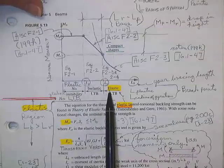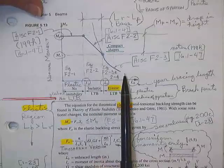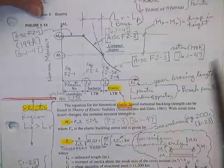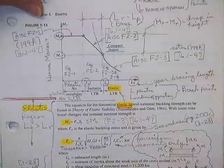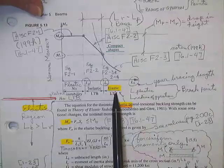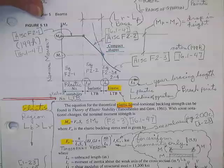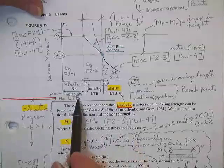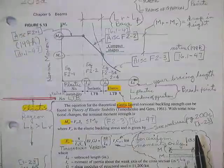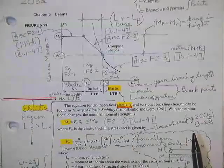This one right here, if the load rolls off because it torsionally buckled over to the side so bad, and they see you going down screaming, and they say, oh, well, man, that's a shame. But when you're back off the beam, it'll pop back perfectly straight because all the fibers were elastic. The first region, every fiber is plastic. It's a mess. But it doesn't buckle. That's correct.